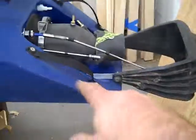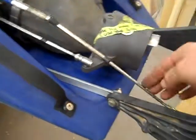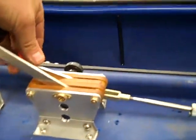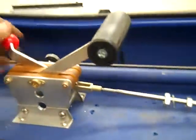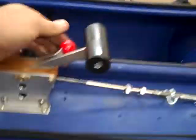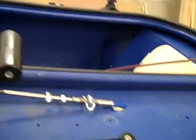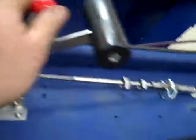You can see it's got a little down angle — we're pulling on it a little bit — but it just slides inside here and has enough flex to make that happen. The coolest part of this whole thing is when the handle goes over center. You can see we're over center when we pass right there. It actually locks in the down position or up position, so there should be no forces from the jet pump trying to kick it back up. Once you push the handle all the way down, you can see it do the little flop — there, it's over center. It truly is locked and doesn't want to pop out.